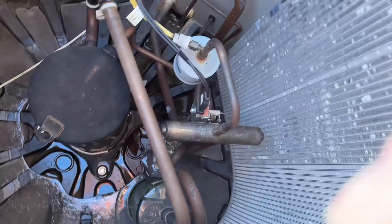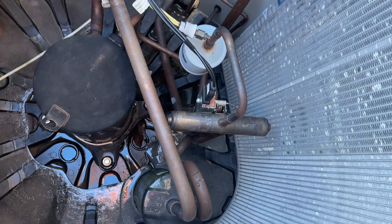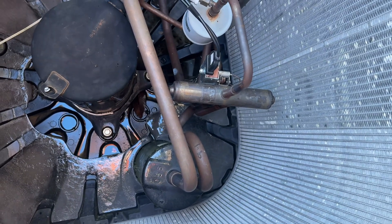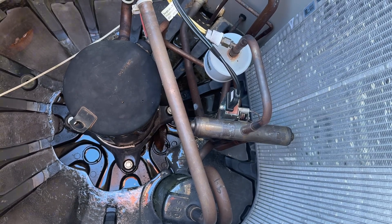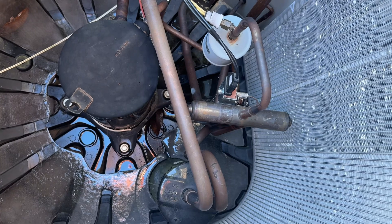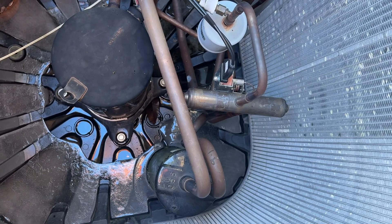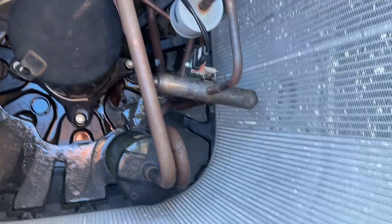What happens with these valves: the defroster board can fail to energize the coil, which won't let it kick over — that's about 10% of the time in my experience. But 90% of the time, inside this valve there is a slider — almost like a torpedo — that slides left and right. It's made of metal, and it will either go bad and be unrecoverable, or it'll stick and you can free it up. The easiest, cheapest, simplest way to fix it: get yourself a large magnet, about an inch wide and two inches long — roughly the size of a cigarette lighter.